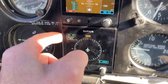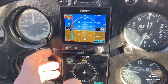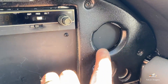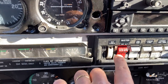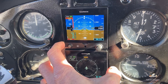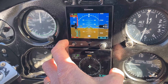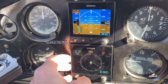And why are the batteries built into these units? Well, the reason is that in the traditional old-school attitude indicator and directional gyro that are engine-driven vacuum pump powered — and normally you'll see a gauge that shows you your vacuum pump pressure — in the event you lost the alternator and then the battery, those two instruments would still operate even in a no-electrical-system scenario. As long as the engine ran, you'd have an engine-driven vacuum pump running, and those traditional attitude indicators and directional gyro would still operate.